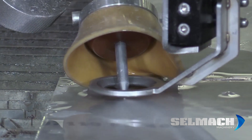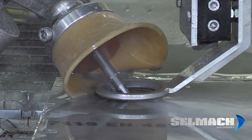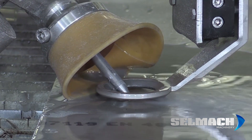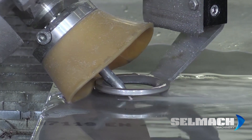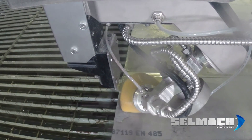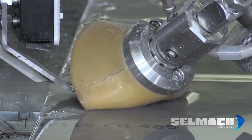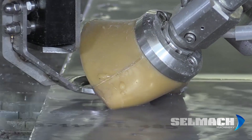For instance, I have a job we've always had plasma cut — we leave seven millimeters on the outside and have to machine it after. It costs me 26 pounds to get it plasma cut and roughly 10 pounds to machine around the outside after. I stick it on the water jet, cut it to size, it's finished — I don't have to bother with the extra machining. I calculate that at about 18 pounds, so 36 pounds down to 18 pounds — roughly half the price.